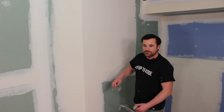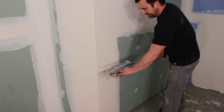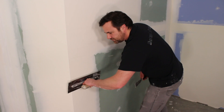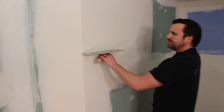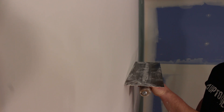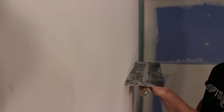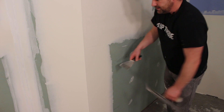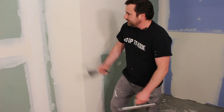It looks pretty good. Some of this may look a little wavy or ugly, but as long as it's straight and it's not proud or sticking out, it doesn't matter. It'll shrink back and on your second coat it'll finish better — you can just sand off these little edges. Now I just want to show you how straight this super butt joint ended up being. My first coat on this bead is pretty darn straight, and that's because I didn't lean my trowel flat against the wall — I held it more square. Let me show you this butt joint — I'll just slide it along the wall. It doesn't rock anywhere and there's no major daylight, so that's pretty flat.